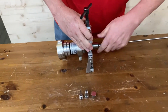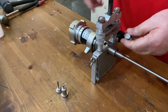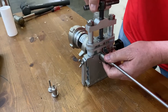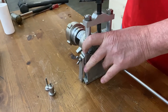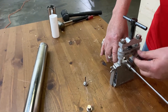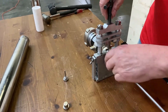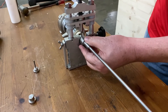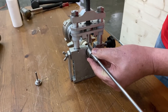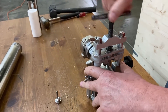You set your piece in here. Make sure you have the end right. The first one you put in is a flat end to push the pin down so it's even with the shaft surface. You just tighten it down. Once it's down to the shaft surface, take that one out and slide it out. You go to the next one, which is a half pin. You slide that in and line it up right with the hole where the pin is, and it will start pressing the pin out. You hold that, tighten it down, and it will push itself in and start pushing the pin out the other end.